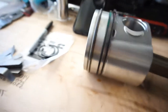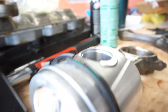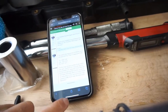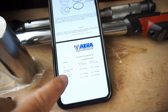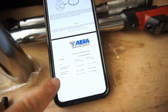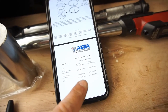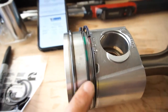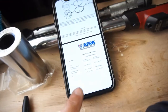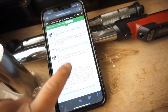So I checked the tolerance of the rings. Oil rings — good. The mid ring, let me look it up real quick. They're calling it a phosphate coated intermediate, or you can get a chrome faced intermediate. They're calling for 20 to 32 thousandths, or 47 thousandths for the phosphate — which I believe these are, because they're not a chrome faced ring.